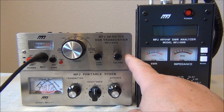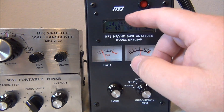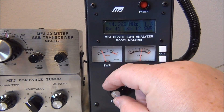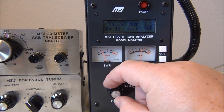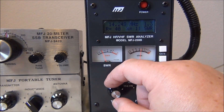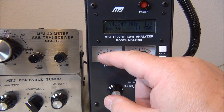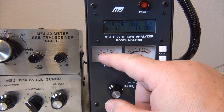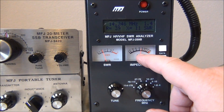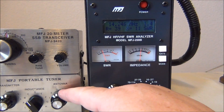I've attached my antenna to the top of the antenna analyzer and adjusted the tune control to about 14.50 MHz. This knob is very touchy — at 14.49 that's pretty close. As you can see, we've got about 1.5 SWR and about 45 ohms. Let's see if we can get that a little bit better by connecting in through the manual tuner.